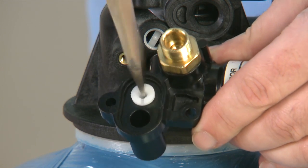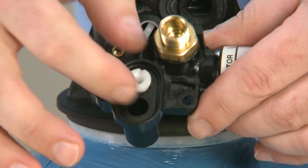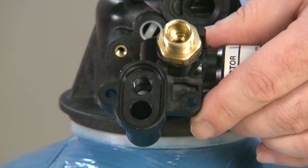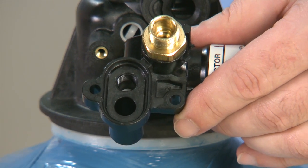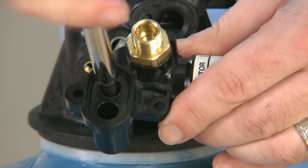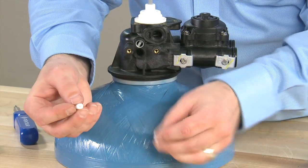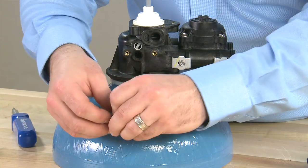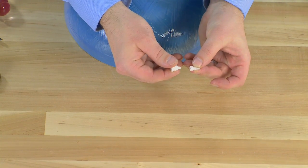We then have access to our two-piece injector. This unit uses our 1600 system for injectors. The top piece — we use a large slotted screwdriver in order to remove it. We then use a smaller slotted screwdriver in order to gain access to the inner piece, which also unthreads. We want to make sure that when we have these injectors out, we check to make sure that there is no damage to any of the openings, orifices, or threads, as the spacing between the two is essential to make sure that the injector works properly.